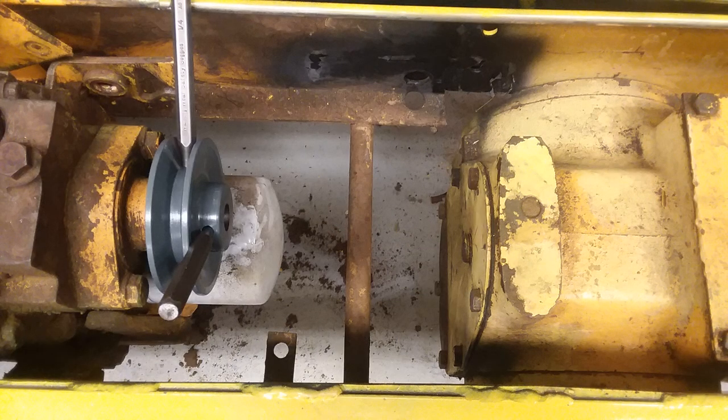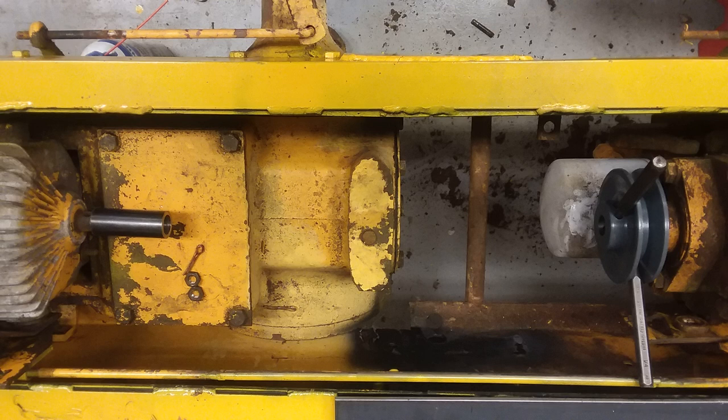On the rear hydrostat is the drive pulley. During the build I used a single pulley but I have since switched to double pulleys, so you'll see the double pulley arrangement at the end. In the first test — kind of a proof of concept — I used a single pulley. There are pin punches in the pulley holes just to align the holes for where the pins go through. You can see the coupling there on the hydrostat to the left. The hydrostats have front and rear input shafts so you can connect them end to end fairly easily.